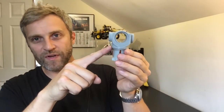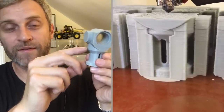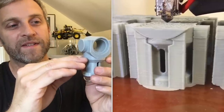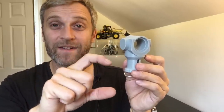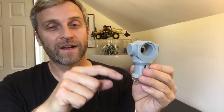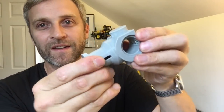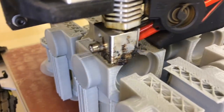I was really loath to start this again, so I thought about how I could resume this print. Basically, I measured how high up the print had got — about 30-something millimeters — then went back into the slicer and removed that 30 millimeters. On my TAZ I fooled it into thinking the bed was that much higher by putting a 30mm standoff on my Z calibration axis, then just prayed. It came down, calibrated at 37mm, and started printing again. These are actually two parts joined back together — you can just about make out the line — so I managed to save 10 or 11 hours of print already done.